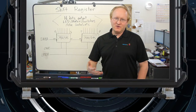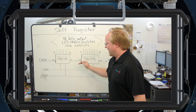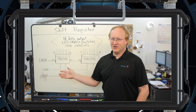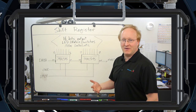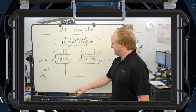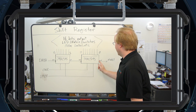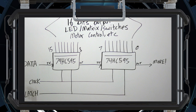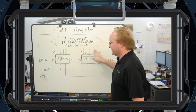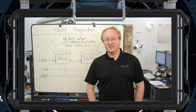Now it's time for a tech timeout. We've been using a lot of shift registers in this project, so I thought I would talk about them. A shift register is an integrated circuit that allows you to clock data in or out serially, then hit a latch line to make it appear in parallel. This is an example of how we did the solenoid control — we didn't have a ton of I/O because a lot of it was used up by the audio, so we conserved it using shift registers. We have just three lines: data, clock, and latch. Every time you pulse clock, whatever is on the data pin will go into the shift register and get shifted down the line — and shifted out to the next shift register, so you can put them in series as many as you want. When you pulse the latch line, the data that you've shifted in will appear on the actual outputs, so you can control when it changes. It changes all at once when you hit latch, which keeps things consistent. If you need more I/O than you have in a project, consider a shift register.